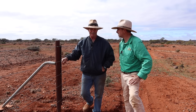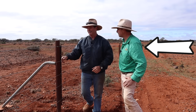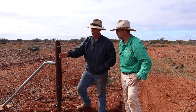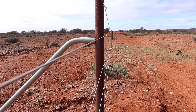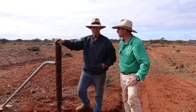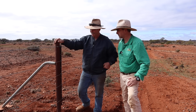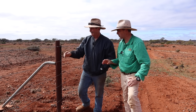Generally speaking, if you can get your fence at right angles to the water flow, that's better. But in this case, our water's coming from my left and downstream is to the right. We've got the wire on the pressure side of the post here, so the post is holding up against the wires running around against it. This post here is a 75mm drill rod, but you can use 80NB galve posts or general strainer posts — anything with a reasonable amount of strength. I wouldn't use a 50mm.